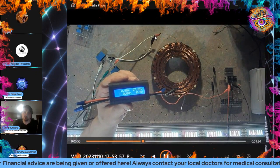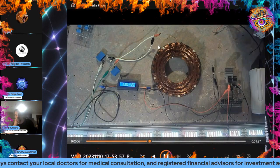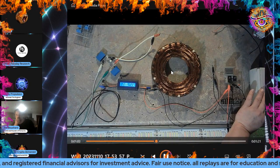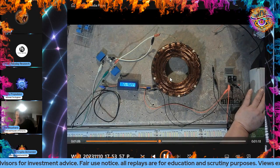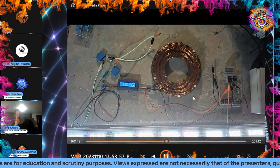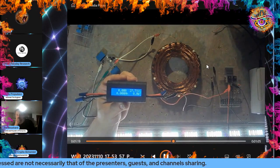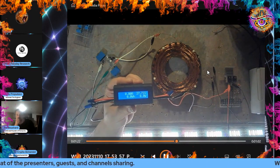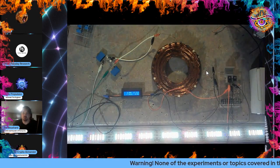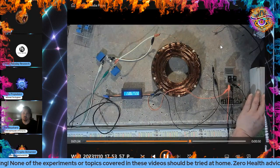Just honest feedback from the view that we are looking at, it looks like it's pretty darn dim. It does. It's about 30% bright. It looks much less from the camera view. Yeah, the camera loves to correct, eh? Just to let you know. Now that's starting to look like we're getting somewhere. That is 10% duty cycle, and still no watts are showing up on the meter. My eyes tell me that's approximately 20 watts of power. It seems much brighter in person, I'll tell you.